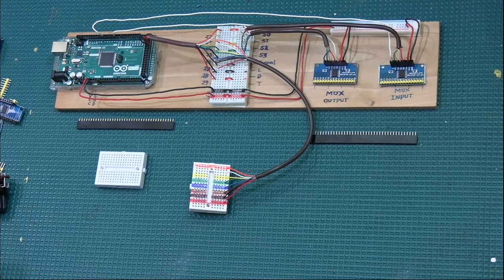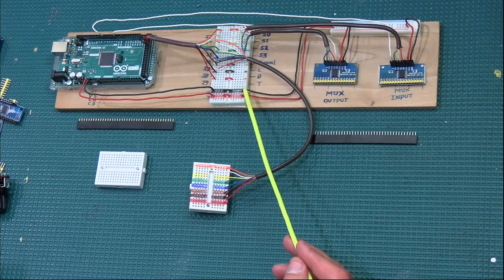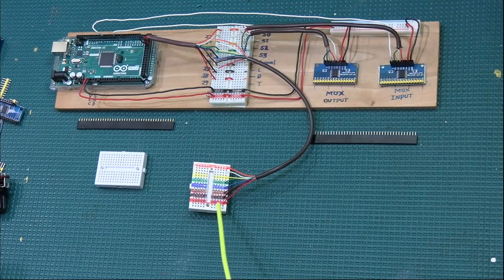And obviously, I would need to also take a power and a ground rail, so I would definitely take another one of those. I would like to use another one of these bigger ones rather than a shorter one, because then I don't have enough room to put the ground and the power. But if you're building this already for a permanent setup, the recommended is that you have a very thick copper wire where all your common grounds are going to end up connecting to. So you wouldn't do it on a thin little wire like this for all your grounds, just to make sure that you have very good connections. So that's what I would do, right?